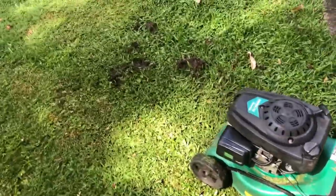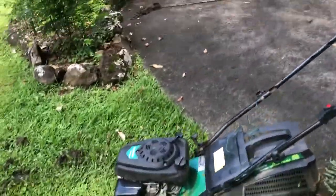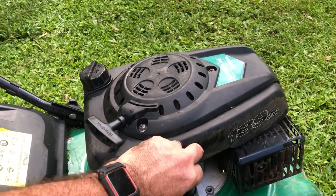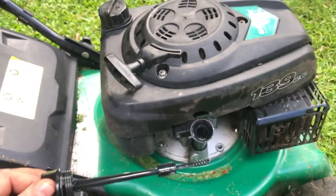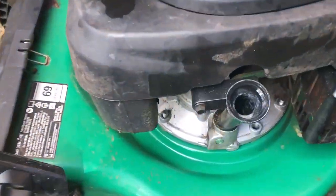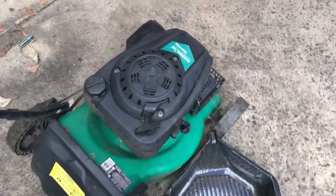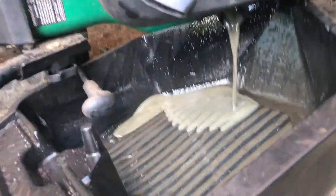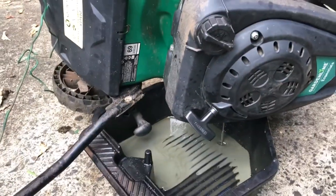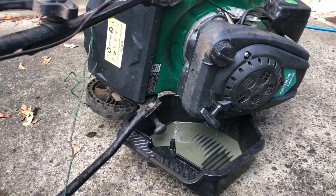It's just starting to run out of fuel but cutting like a champ. Once it cools down I'm going to give the oil a change. I've got lots of mayonnaise in the oil - lovely. Now while it's nice and hot I'm going to drain the oil and see all the milky residue rising to the top. I'll get all that out and same drill - pop the drain plug out of the sump and let it drain overnight.